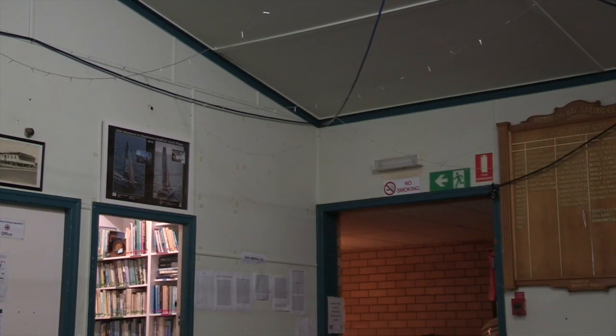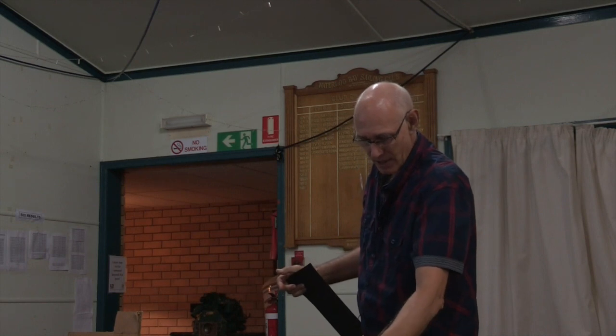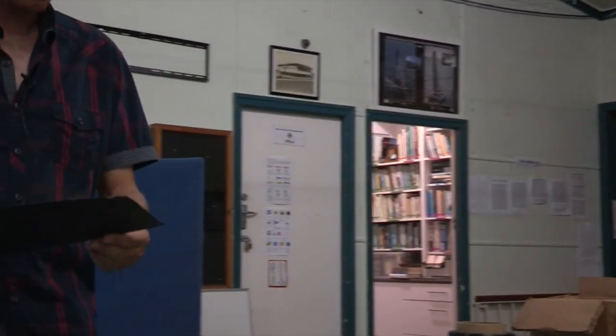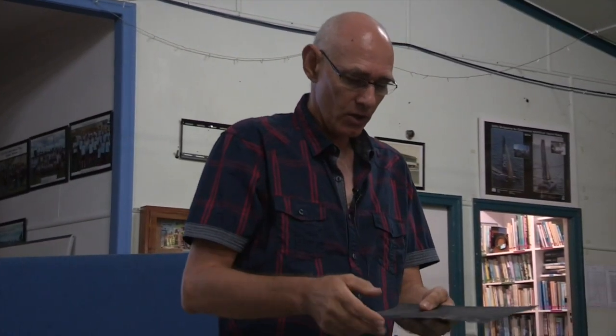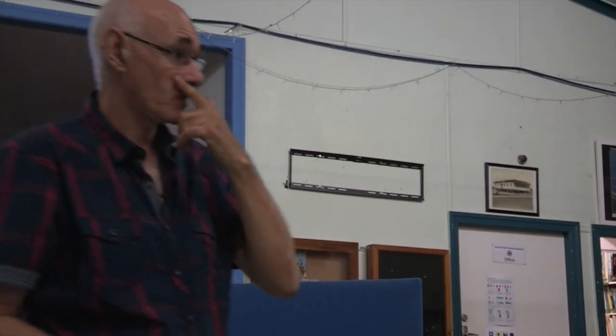This sailcloth, they join it together with an acrylic resin. Oh, this is dying, this is aging right in front of us. I bought that in a shop up in far north Queensland probably 25 years ago. Now it's dying. Plastic, you can't trust it. This is a piece of the main sail of Blackjack, and if you want to repair it, you use a urethane adhesive. You give it a wipe down with acetone, get another piece of that, stick it on top, and use a Loctite urethane. And they're really good.